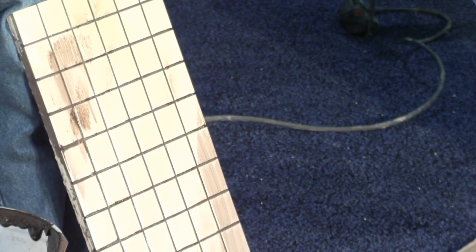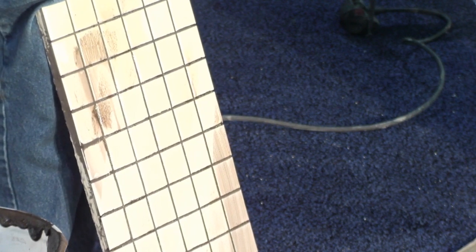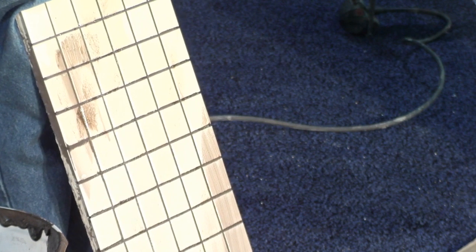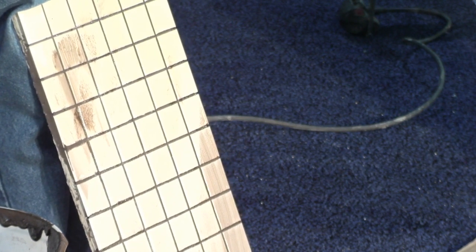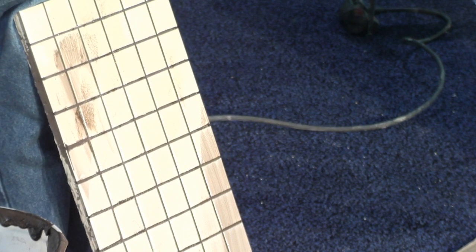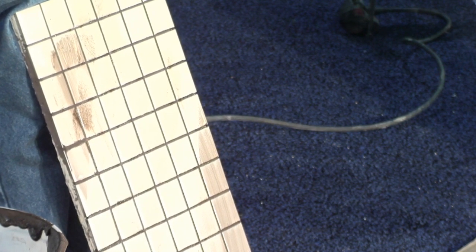Next day, tomorrow morning when we come in, the grout in these joints will be at 3,000 or stronger PSI strength. We'll be able to actually grind metal on the grout joints. They'll be that stiff, but at 8 hours, we can still work them to get them to come out if your installer does a really bad job.